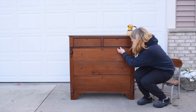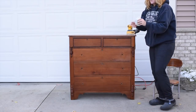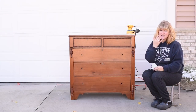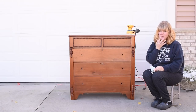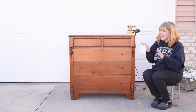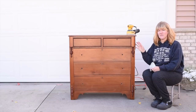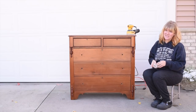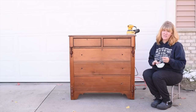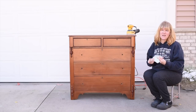I'm going to wear a dust mask. You definitely want to wear a dust mask when you're sanding furniture — not only does it keep your nose clean, but if you sand without one you will end up with a bunch of dust in your nose and be blowing it out throughout the day. Also, you don't know what kind of finish is on the piece, so you don't want to get anything potentially harmful in your lungs. That's another good reason to do it outside. If you're dealing with a piece that has lead paint, don't use this sanding method — go to the EPA's website and find out the proper steps when working on a piece with a lead finish.